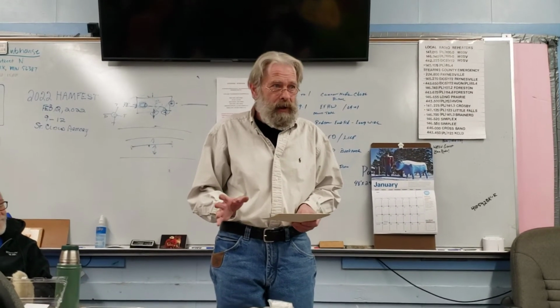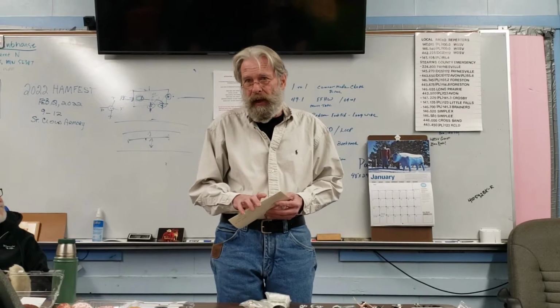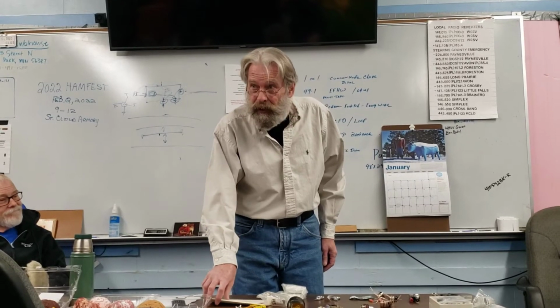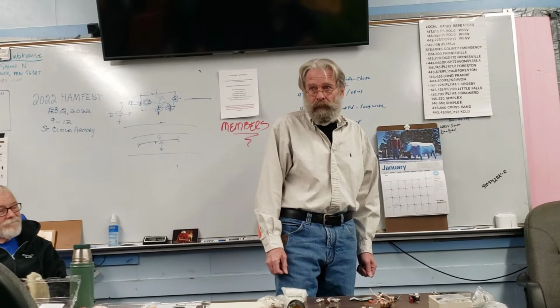Sometimes it's very easily handled with an onboard tuner, but a tuner of some sort is needed to bring that down under 2-to-1. There are some alternate lengths, but that'll give you an idea of the different varieties, and any one of those lengths will get you on 160 through 10 with a tuner.